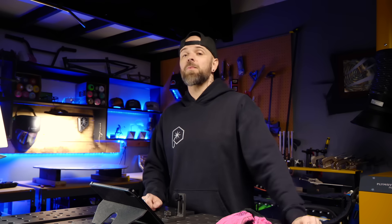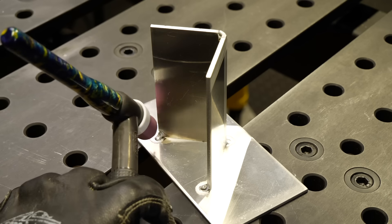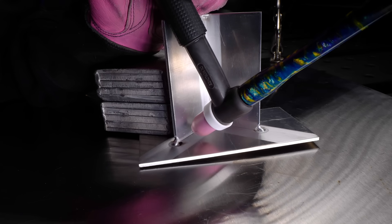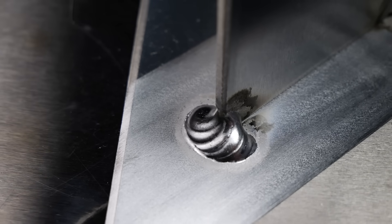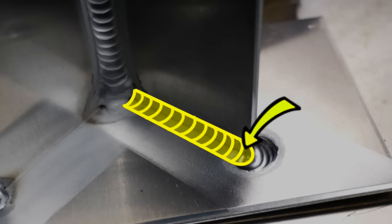With the passes around the base, you can decide which way to travel. You can set up with a normal grip, but I always prefer to stand on the other side and weld overhand — I can see much better and my fillet welding is more consistent approaching the joint this way. I love welding fillet joints overhand; comfort and visibility are way better. The first thing I'm going to do is start with a corner wrap to make sure we don't leave any open corners anywhere on your project. Make them blend out, follow a nice profile on the bottom edge — it's almost like a little rainbow — and now I have a perfect pocket to start my next pass.